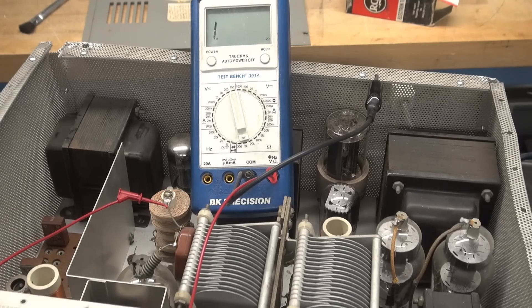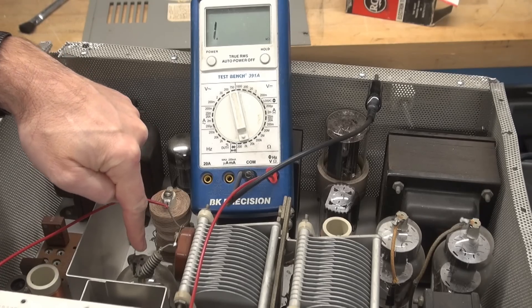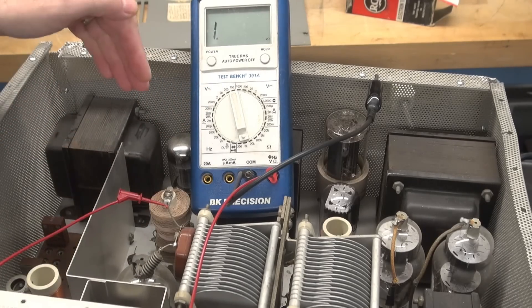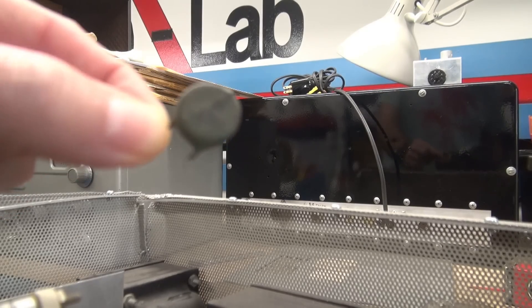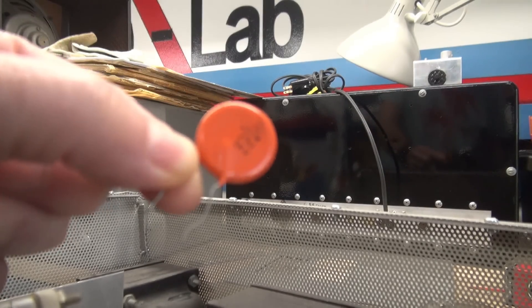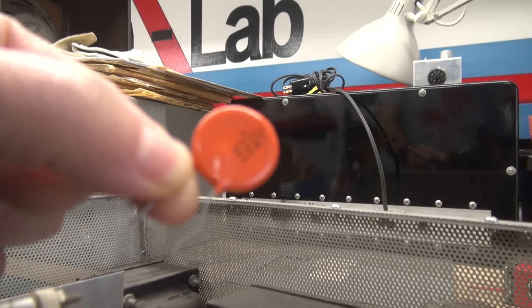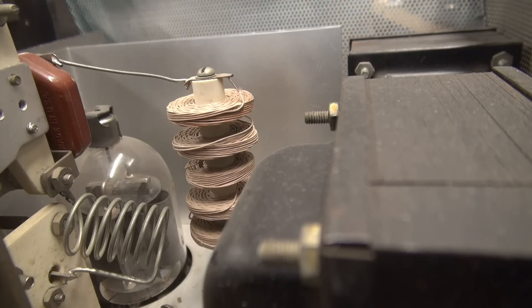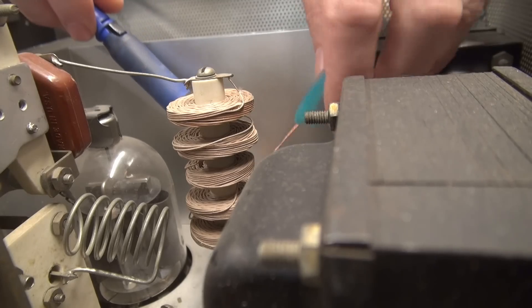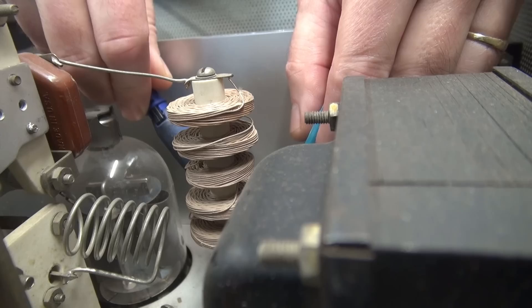Let's change out that cap and try to reapply plate voltage. This may be easier than I thought, and the good thing is, since the short was down there, it didn't come up through the choke and it's not the tube — this tube was never seeing high voltage to begin with, it was being snubbed to ground. The original cap is 0.01 microfarad at 1.5kV. I'm going to replace it with a 0.01 microfarad at 3kV — a little bigger but there's plenty of room. The hardest part is working in a hole, so I'm grabbing some solder wick to clean those terminals.